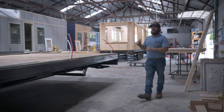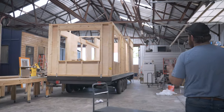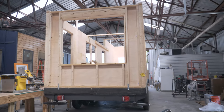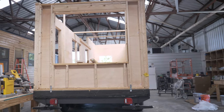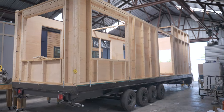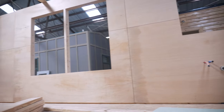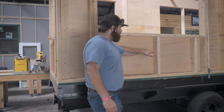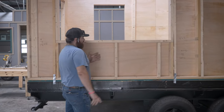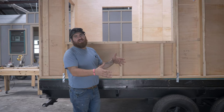Let me show you what one will look like before the roof's framed on and how it looks when it's framed from the inside out. Ahead of me right now we have a 32 by 8. This is a model tiny — like our other 24 and 28 model tinies, it just happened to be 32 feet long. You can see in the back it's got two picture windows, and if you take a long shot down you can see this thing is long and skinny. If you look inside, you can see that we attach the inside walls first. Another reason we do that is because when our guys are out here, all your electrical outlets are at waist level. So we don't have to crouch down — we can just cut our boxes in, wire it up, staple it, make sure everything's insulated, and all the plumbing gets done out here. That way I can have a guy working on the inside and a guy working on the outside at the same time.